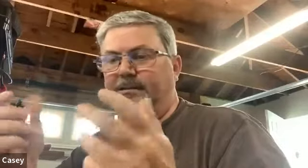That's a good tip. That way the bit is always touching the wood, but I know the distance from the end of the router to the end of the bit is always the same as well. So by going to the Z home position before you change out your router, your bit should just be touching the wood. So you can just undo the 2 bolts, slide it out, put the new bit in, slide it in, let the bit touch the wood, and tighten down the 2 bolts. Yeah, that's a great tip. There are lots of little tiny things like that you'll learn from cutting experience.